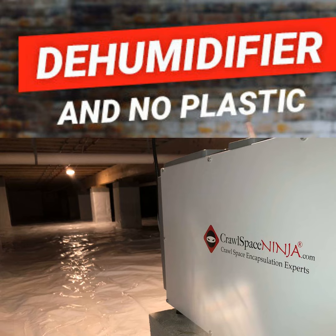So if you had your home built with an open vented crawl space, you're allowed to throw down loose-lay vapor barrier. But as soon as a company like us goes in and seals those vents — it doesn't matter if we install a dehumidifier or not — as soon as we seal the vents, the loose-lay vapor barrier is out of code. So we encourage you: if you are planning to install a dehumidifier, plan to encapsulate the crawl space with a good vapor barrier, because that is going to keep the moisture in the ground at bay so that the dehumidifier can cycle on and off properly.